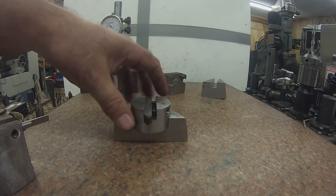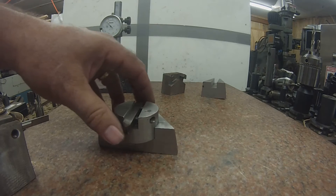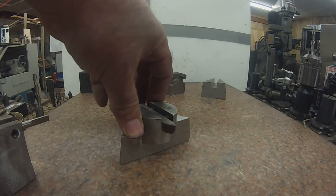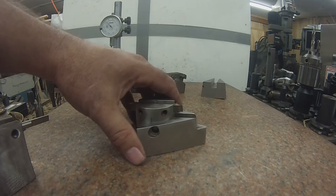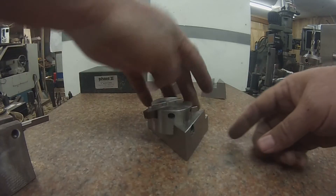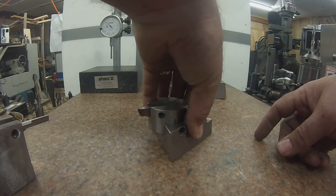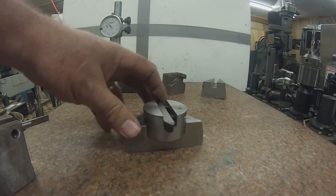It's not perfect — I know the angles are maybe a hair off. But the tolerance on a thread is half a degree on the side, so I don't think it's half a degree off. The reason it's slightly off is that the angles here are right, but when I tilted it down, that's going to throw the angle out a little bit. So you don't have to tell me about that, because I know about that.